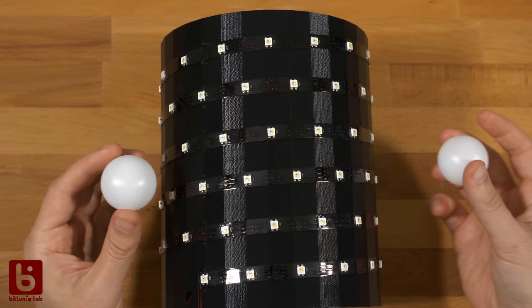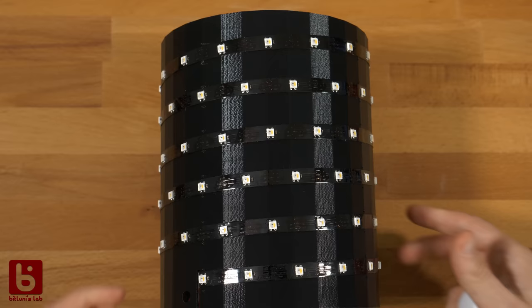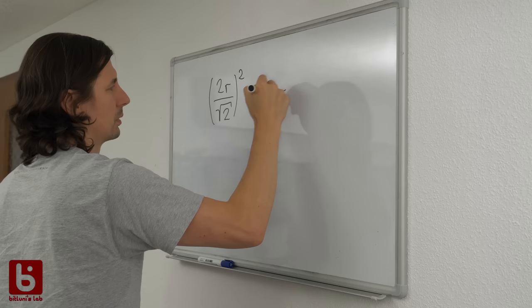That means if the strip is glued on an arced surface, we can still use the off-the-shelf components. Since we can get strips that are up to 5 meters long, we can spiral the strip around the tube at a slope that will automatically create a nice coverage of the whole surface. To find out the optimal diameters and LED counts per revolution, I only had to solve a few quadratic equations. Easy!